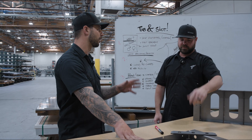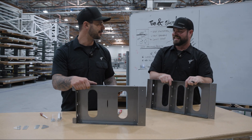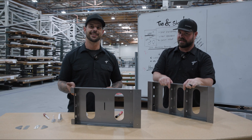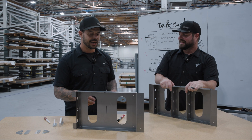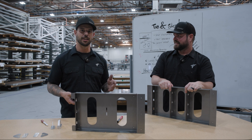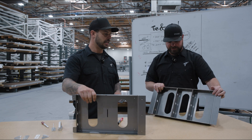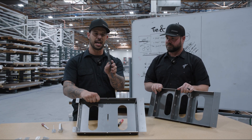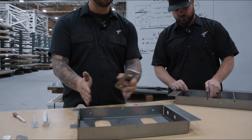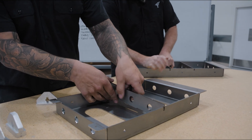This is a really good example of what we just talked about. I bought an ambulance — I'm always doing random stuff. I think her name's going to be Amber, like Amber Lance the ambulance. Amber has a roof that is five foot ten. I'm five foot ten, but my wife is six foot, so she wasn't really happy about the height difference. I'm extending the roof up ten inches, and I have these heavier 0.187 mild steel gussets that I want to be separated out nicely to weld in. I ended up using two different tab and slot methods.